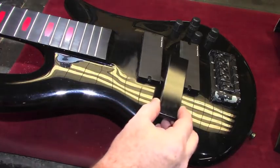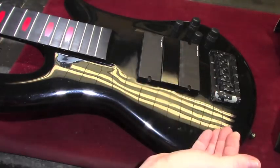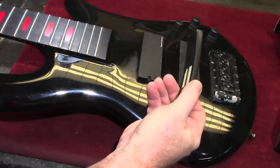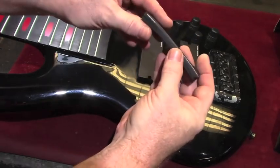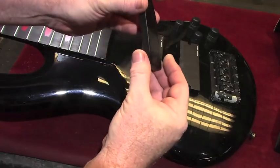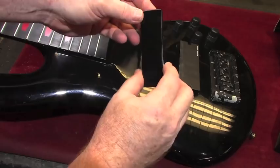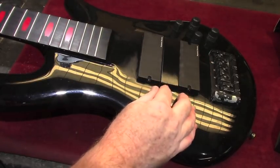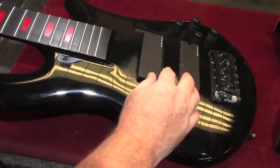This is one of the two basses I've made a speed ramp for. That's going to get installed right there. This is a piece of poplar that I hand-shaped and sanded, and then we've coated it with four coats of polyurethane combined with black stain. The black goes quite deep into the wood and it's a nice hard exterior — should put up with an awful lot of fingernail abuse.